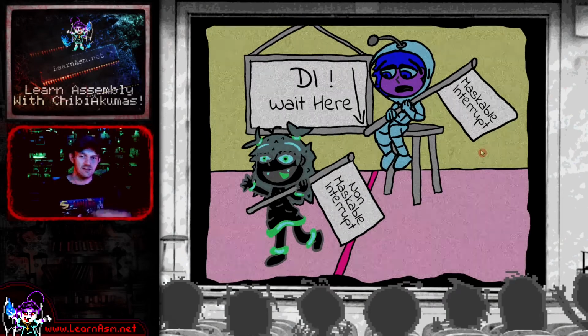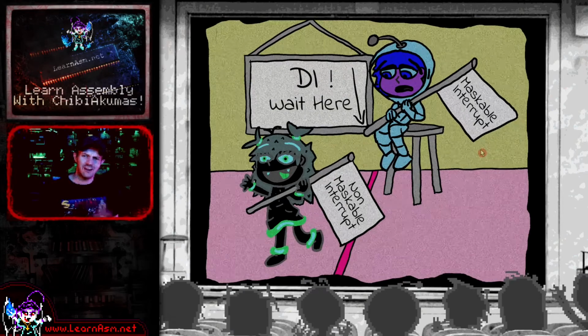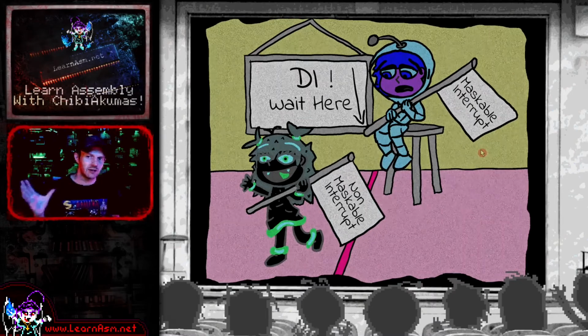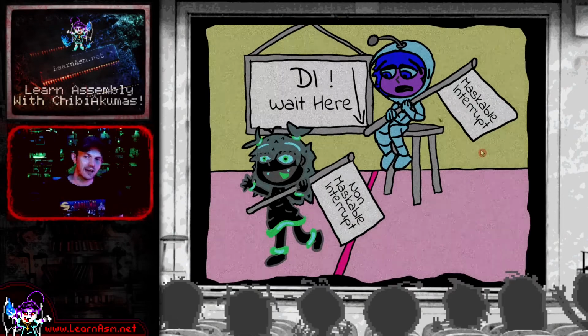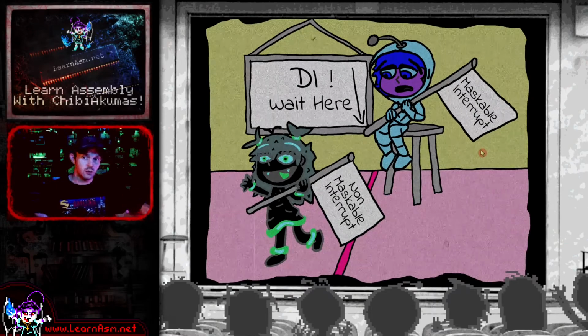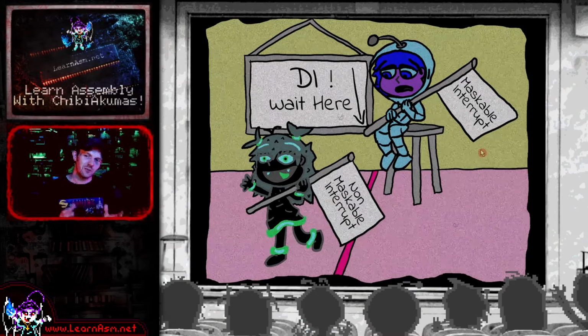You know, maybe we're doing something really time critical, or maybe we're using the resources the interrupt needs. Now, generally speaking, we would know that on the Z80 there's something known as the shadow registers, and if we use those, that could cause problems for our interrupt handlers. It's not something that you're going to need to worry about too much as an absolute beginner, and generally speaking, you would probably be better off just disabling interrupts. But there's actually two kinds of interrupts that might occur.